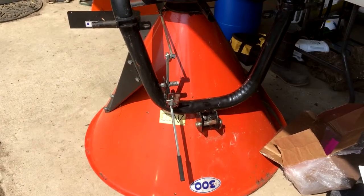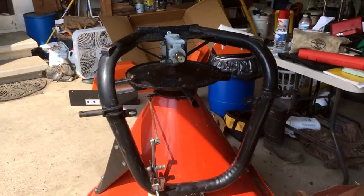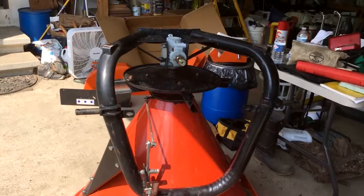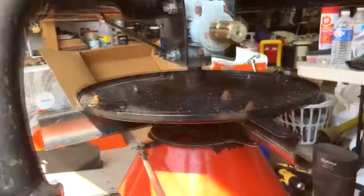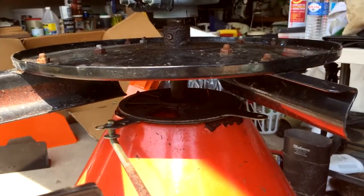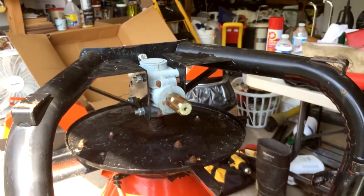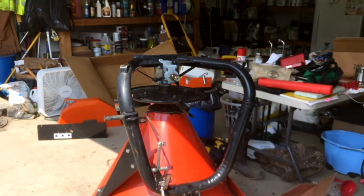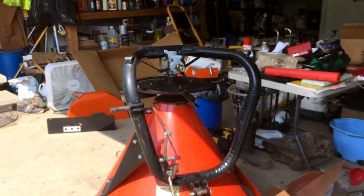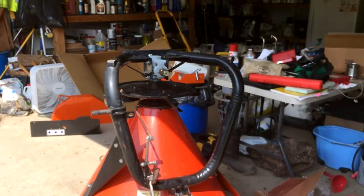So far it seems you can leave the gate adjustment — that's the volume control — in place. A pro tip: now is a really good time to spray penetrating fluid or lube onto those discs, because once you enclose this it's going to be really hard to service them, and fertilizer is pretty corrosive. First of all, get someone to help you flip the thing over — you don't want to try to work on this on the ground or installed on your tractor.